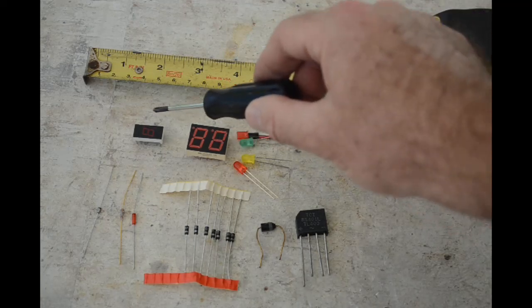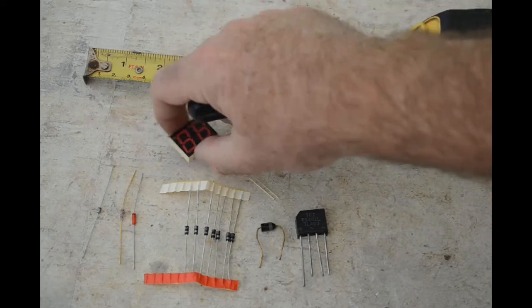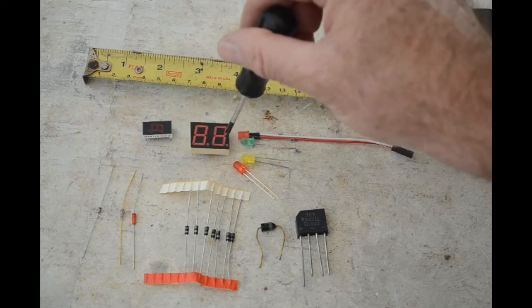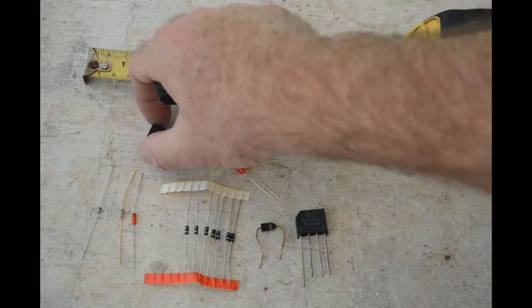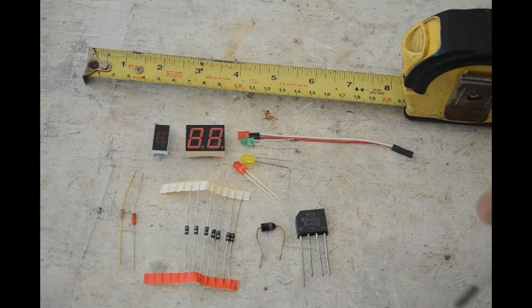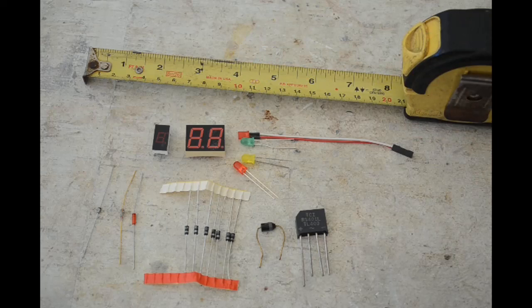And then you've got these 7-segment displays, which are basically groups of LEDs. So here you've got two 7-segment displays, so each of these is 7 LEDs in here, so you've got 14 LEDs, plus 2 decimal points, so 2 more LEDs, so you've got 16 LEDs in this package. And this package here has 9 LEDs in it, because it's got the 7-segment display and a colon. So this would probably have been for a clock, and this would be more for a calculator or something. So you've got a lot of LEDs in these packages. And each LED has a little bit of gold in it.